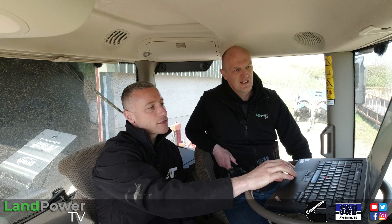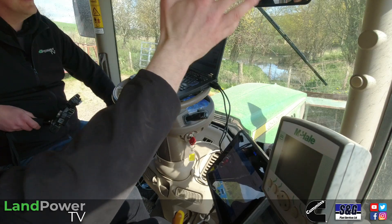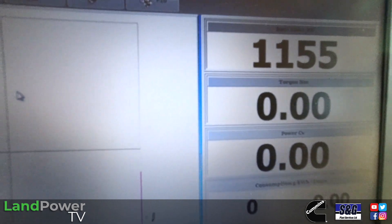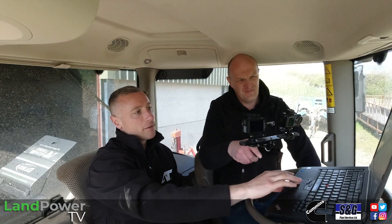So we're ready to rock and roll. I'm going to run an F1 test, which is a normal power and torque test — taking it from maximum revs all the way down to 600 PTO speed. We could take it lower, but there's no need to overstrain the engine. That's maximum revs now at 1150 PTO speed — that's the tractor absolutely flat out. And I'm going to start the test.